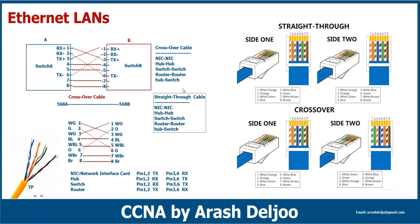We will use all of this information in our scenarios, so it's very important. When connecting a NIC to a hub, they use different pinouts, so you need a straight-through cable — connecting pin 1 to pin 1 and pin 2 to pin 2. When connecting a NIC to a switch, you also need a straight-through cable. Similarly, connecting a hub to a router uses different pinouts, so a straight-through cable is needed. The same applies to switch-to-router connections.